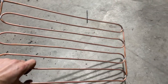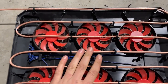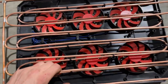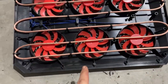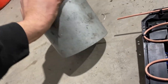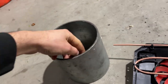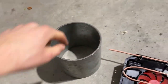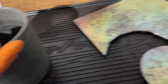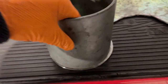I had a change of plans — originally I was going to go with that but I've decided to do a different version. I've got my original cooling pad and I've just fed it along here. This way is a lot neater and more compact. I'm going to run this round and I've got this as my water tank, which is just some bit of metal I found in the workshop. I'm going to put a plate on the bottom, fill it with water, and have a little pump in the middle with maybe some spiral copper so it can cool down in the water. I needed one end blocked off, so I cut out a circle of metal and I'm going to weld that on.